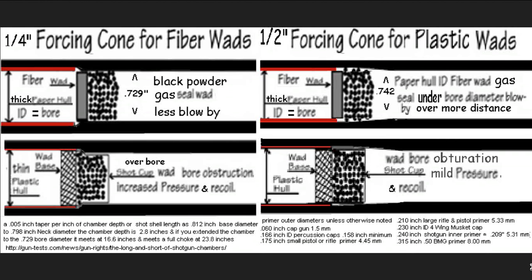If you're not aware, the old design would have an abrupt end at the chamber mouth — that's the fired length. It could be shorter and then open up. Once the shell reached there, the transition from the diameter inside the shell should be a short jump. The wad column acted as a spacer so pressure would never release before it got the pellets into the barrel. The paper hull was thick enough that you had to have a larger chamber for this to work.